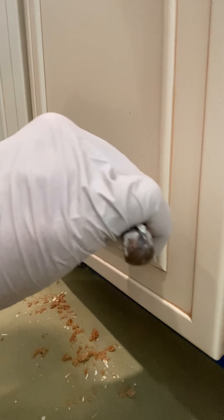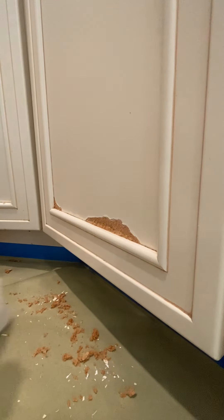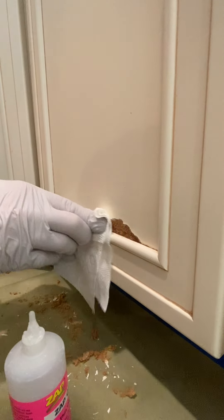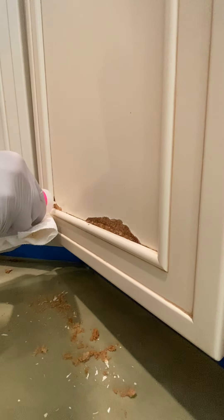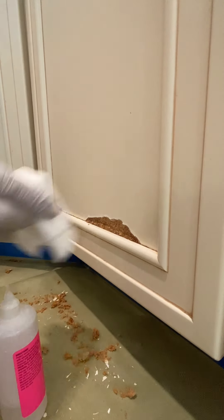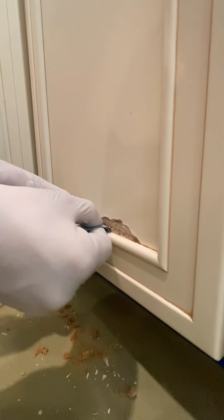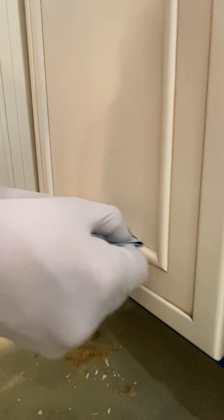Then I follow along with this special CA glue. It's extremely thin, thinner than water, and also very toxic — I always wear a respirator when using this. But the MDF soaks it up faster than it could even soak up water, and once it comes in contact with the MDF, it hardens like a rock, making the MDF sandable. We need to be able to sand to get it as smooth as possible; without the glue, it'd be like trying to sand a wet pile of sawdust.